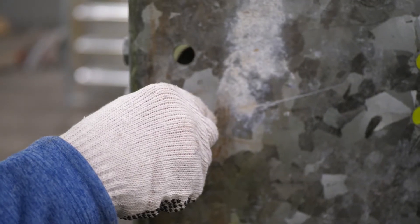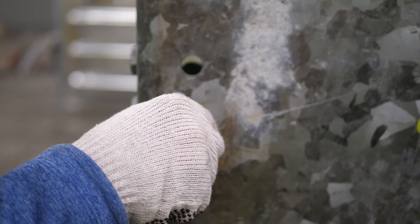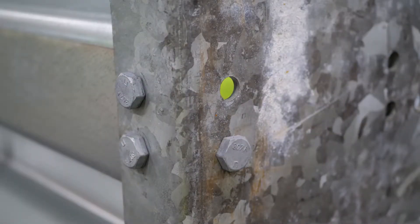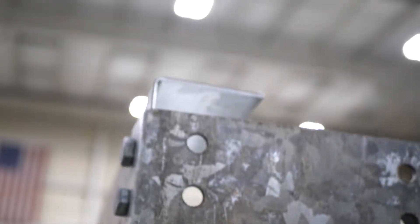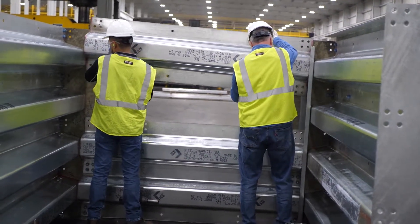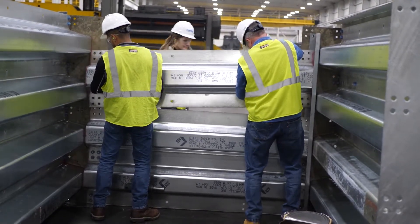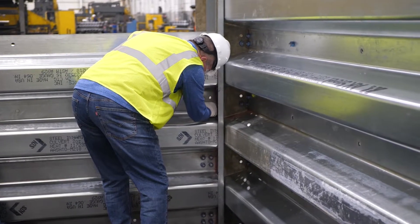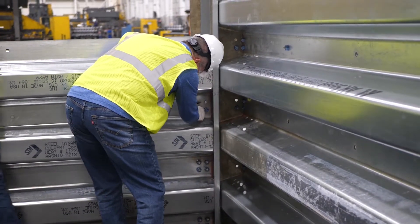While almost all punched holes are used to bolt components together, there is one that will often not be used. The hole pair in the spacers: when bolting spacers together, only one hole of this pair is needed. Both holes are needed only when attaching split vertical connectors, which are used when wall depth design is changing during a wall run. On the external transverse sections, you should use bolt nuts to fill these unused holes and prevent bin fill from escaping.